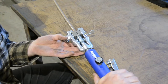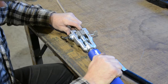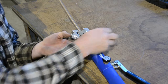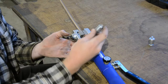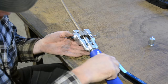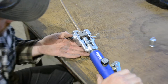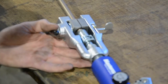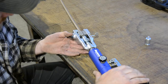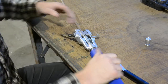Now it's sacked out. I'm going to give it one more little quarter of a squeeze. Release it all the way back. Pull that die out and put this one in — it's just shaped like a cone. This will give you a 45-degree inside flare on it. Same deal — make sure you get started straight. They're tightened up. This one you don't have to smash as hard, just give it a little brief rate down there.